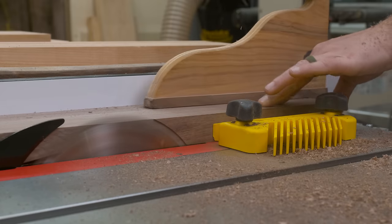Once I triple checked my placement, I took the chop over to the drill press and drilled the hole for the mounting pin. This operation was pretty tricky because the hole has to go all the way through the chop, and it's obviously nine inches thick. I did the majority of the work at the drill press and then finished it off using my hand drill — thankfully everything met up perfectly. Once I completed the same operation for the leg, I could drill in the through hole for the glide screw.